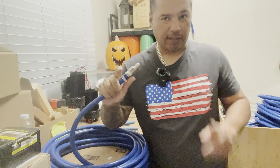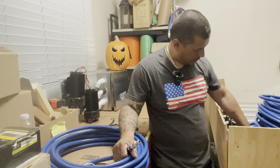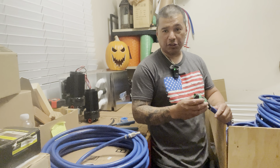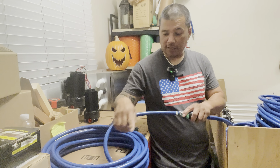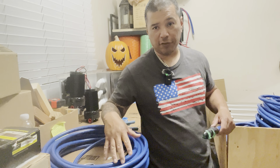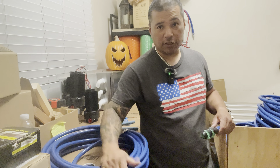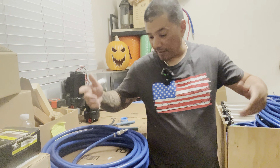This is his final hose. If he decides to pull 50 feet out of his system, I already have everything taped up — I was just waiting on the hoses to ship this out. There's a female quick connect that comes out of the system; you can position it wherever you want, mount it somewhere, and whatever hose you decide to use, hook it up to your system right there. Remember: if you only decide to use 100 feet, your leading hose is the one you'll use — you cannot start with a 50-foot as your leading hose. I personally prefer to go 50 feet then 100 feet followed by more hundreds, but it's a soft preference. His 100-footer hooks up here, then he'll have the Y-valve with connections for his water-fed poles, and that's it.